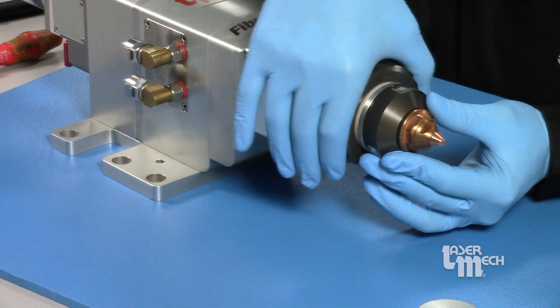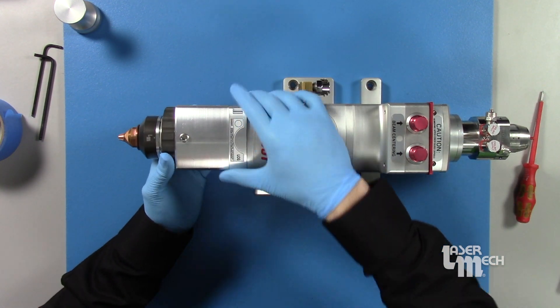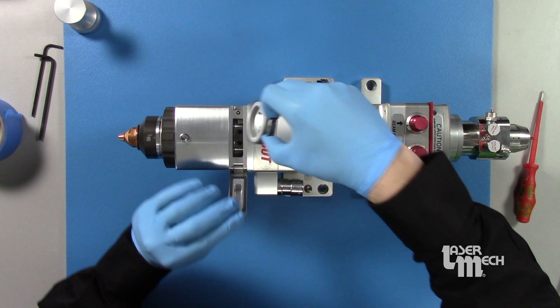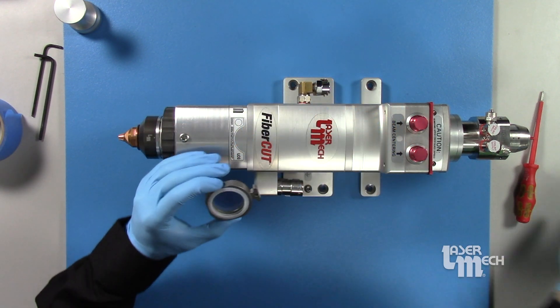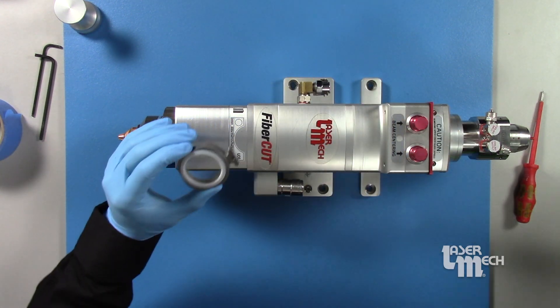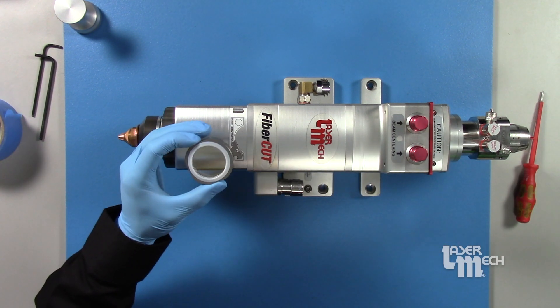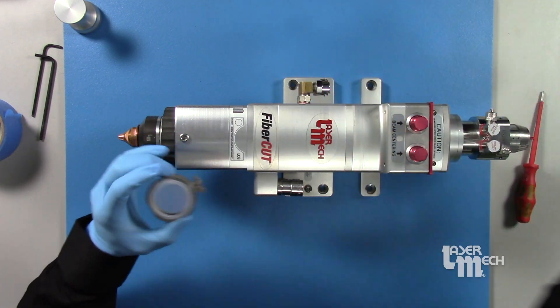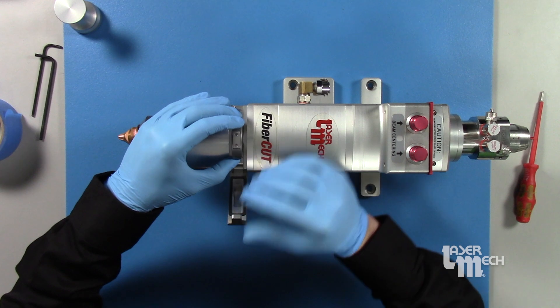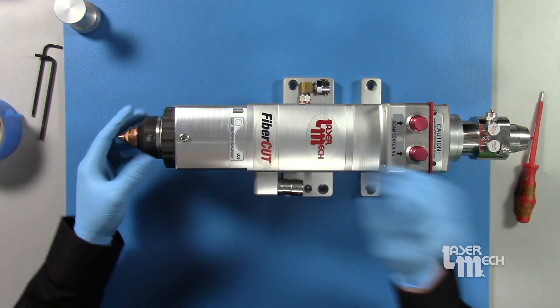Since we had the lower manifold block off, we're going to check our lower cover glass — make sure no contamination got on it. Get your single bulb LED flashlight and give it one quick look, then clean dry air if needed. Everything looks good — place that back in the head. Make sure your door latches and seals properly, and with that you're all set. Be sure to review your instruction manual for complete operating and maintenance information. Thanks for watching.